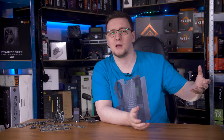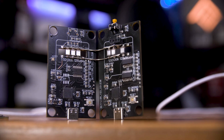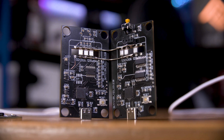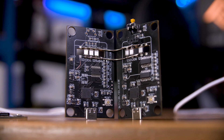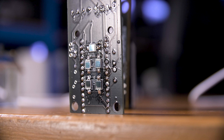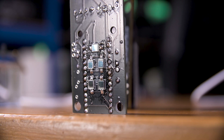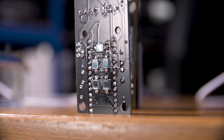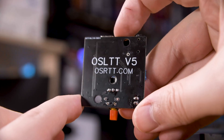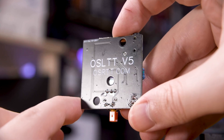Since I was planning on redesigning the tool anyway, I took this opportunity to not only improve the gain function but the light sensor in general. I did an awful lot of testing with different configurations, even MacGyvering an interesting contraption to test a higher number of photodiodes than I had originally designed. I've been using OSRAM BPW34S photodiodes — specifically 5 of them on the bottom of the board — and they work fine. But single-sided manufacturing works an awful lot better, and since I'd already moved to reverse-mount photodiodes for the latency tool, I decided to swap to them here too.